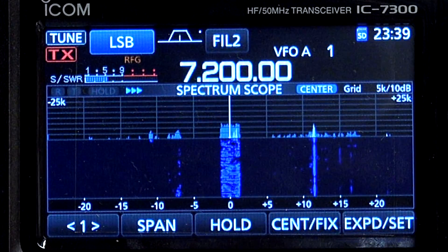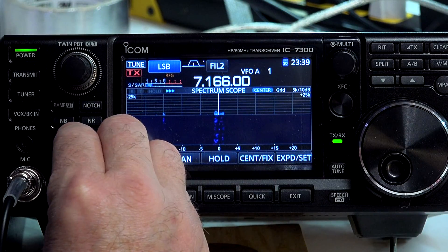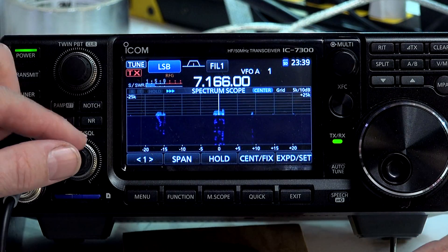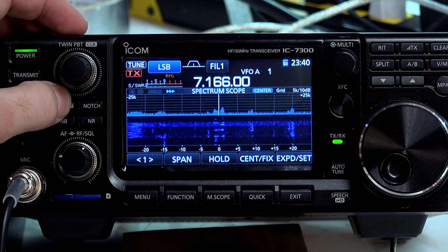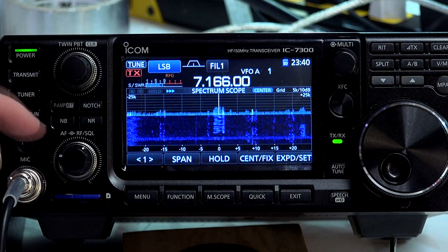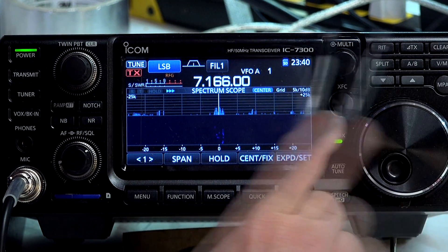And I think that sounds pretty darn good. Except for a little interference. The KX2 — that's either direct conversion to 0 Hz IF, or the KX3 can either be a direct conversion to 0 Hz or to an 8 KC IF, if you want to do that. So I love that.